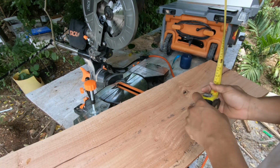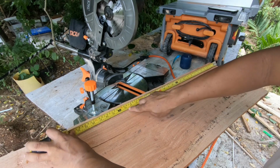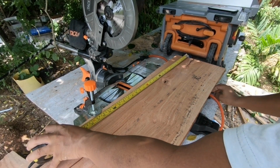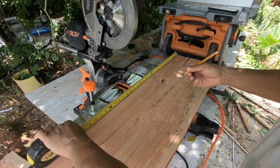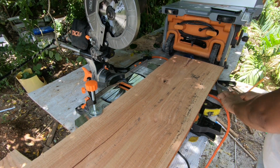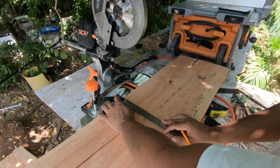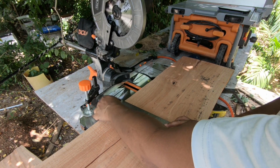That's how I cut them at the yard, for transportation. So that means that I can cut this to 22 and know that the other side there will be 22, and it gives me an inch to play with when I'm making the correction. 2 inches to play with. So I'll go ahead and mark it at the 22 mark. And at this point, it doesn't really matter whether or not it's straight. I am just doing this to get a cut down. Remember that this is not jointed. It's just for me to cut.